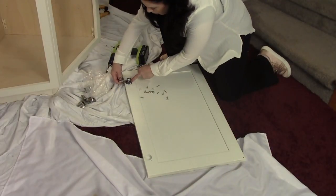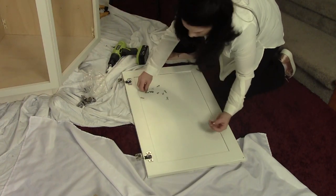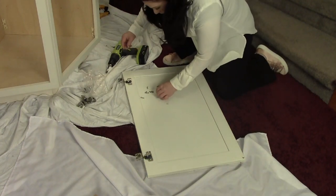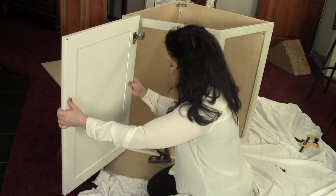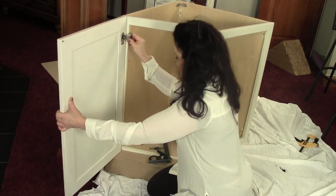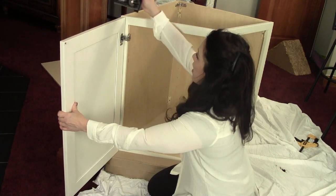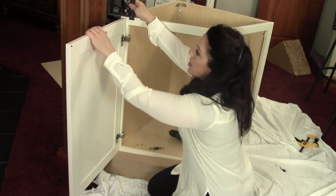Two soft-close hinges come with the doors — they pop right into the openings. I have a couple of little bumpers I'll put into the corners — they pop right in place. Then I'll take some short screws and attach these. Now I'm getting ready to attach the door to the face frame, taking this part of the hinge which has one hole in it, pre-drilling a hole, and getting everything secured. I'm propping it up on a box, which is really helpful if you're working alone. I'll measure from the top down to make sure I get the same door height across the entire base unit.